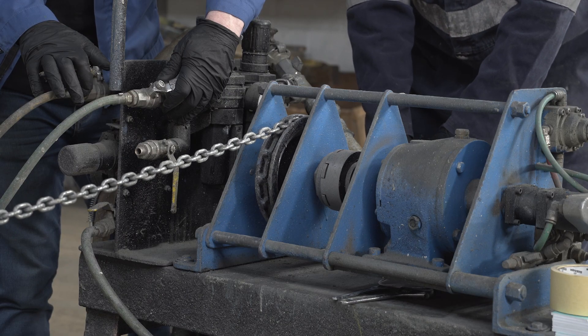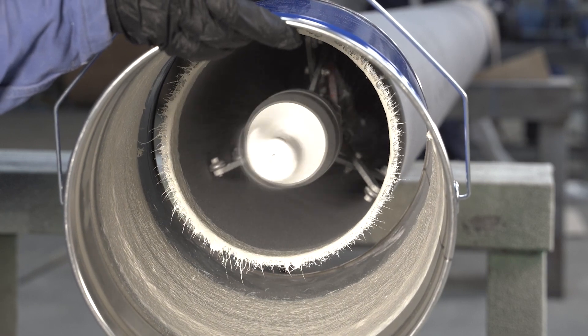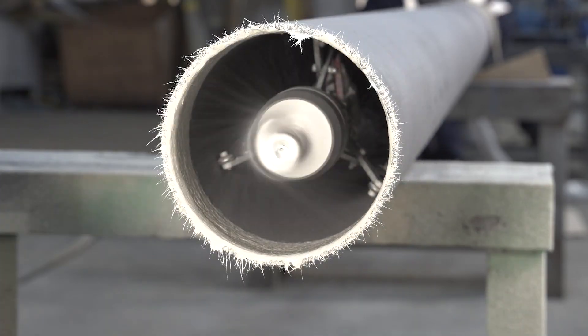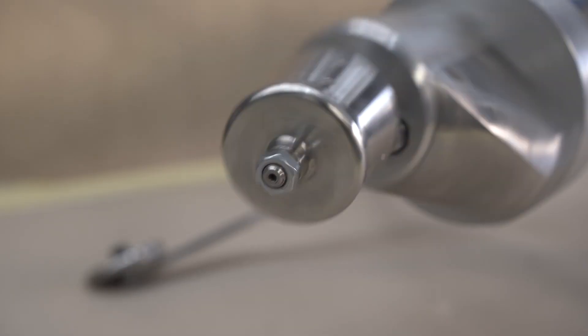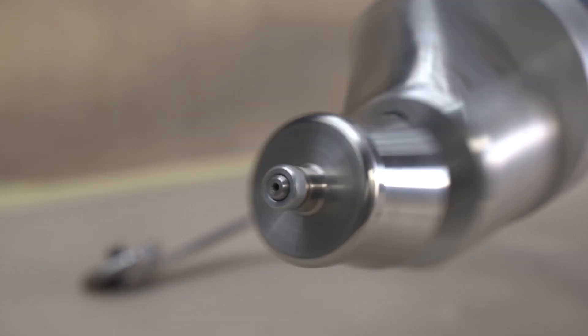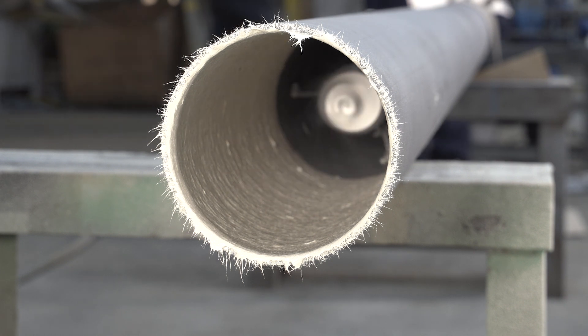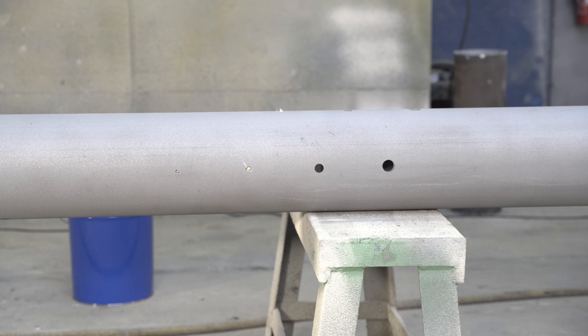The winch is then started, ensuring chain tension at all times. The coating is atomised by centrifugal force produced by the specially designed spray cup. A fan angled spray pattern is produced through the spray cup being angled to the rotating head. The coating covers hole sizes up to 12mm in a single coat and up to 25mm in two coats, depending on the dry film thickness achieved.